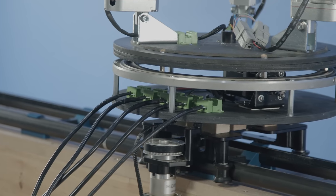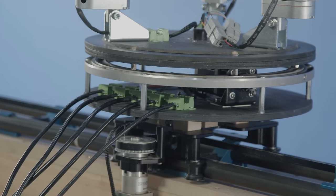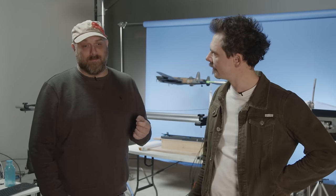As you can see there are a number of cables going into this mover. Each one of them controls a servo or motor. They're technically two different types of motors — we're using stepper motors. We could be using servo motors, which is a different type that can interface with the system we've got. There are pros and cons to both. For our purposes it's been a lot cheaper and more accessible to set up using stepper motors.